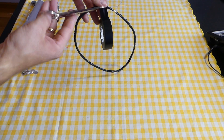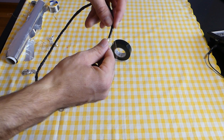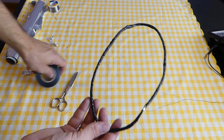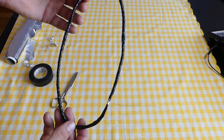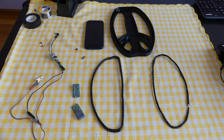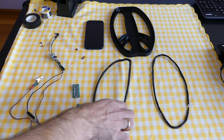The receiving coil is ready. Remember, we make the screen just for the receiving coil. Now we need to adjust the resonance frequency on both coils. To adjust the resonance frequency I will use my app, Resonance Finder — you can find the link in the description of this video. We have to find the adequate value of the capacitor which is connected in parallel with the coil. Before we start, we put both coils into the 3D printed model.